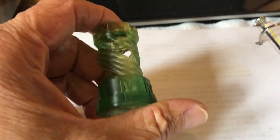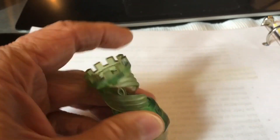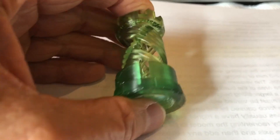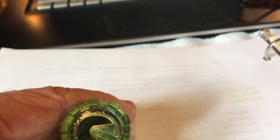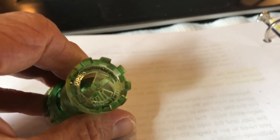After UV curing, we have a finished rook and it is awesome. You can see all the detail — it's very smooth. The layer height is 0.05mm, which is crazy thin. You can go down to 0.025mm with this machine. You can see through here there's a lattice in the center, a staircase that goes all along the outer band, a little cut-out section, and the text is nice and crisp. The reflections off the text in my kitchen lights — I don't even know what font size that is, it's incredible.